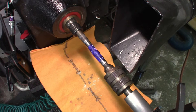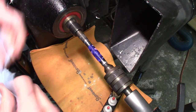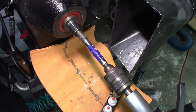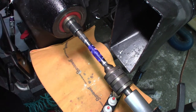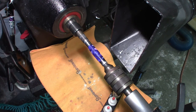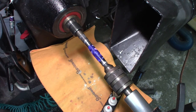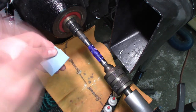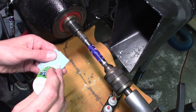Still on the hunt for, and I think I mentioned this on one of the streams before, I'm still looking for a paper towel that is non-abrasive. One of the things I'm looking for is something you can buy in a roll, like paper towels. That would be fabulous if they have something like that. Some of these paper towels are actually quite abrasive. So if you're putting on a plastic polish that has a super high grit level, and your paper towel has a grit level of less than that, then you're not really winning the fight. You're only going to get it as high as that paper towel. Come on. There we go.